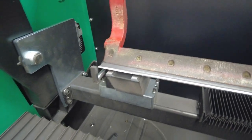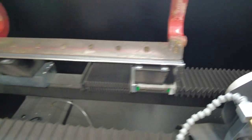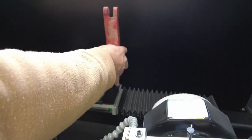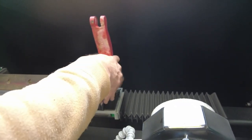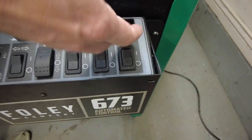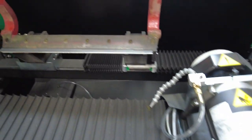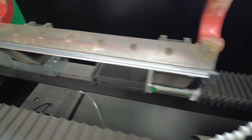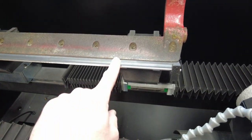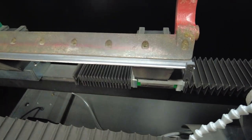To mount these bed knives, we pull these stops out — one here, one here — and then Mr. Crowley is going to slide the bed knife right to the edge of those workpiece stops. Got it. Very nice, and there's just a switch here that turns the magnet on and off. Magnet activated. How tight is that on there? That sucker's on there. Super strong electromagnets hold the bed knife on, and that gives you access to the top face and the front face of the bed knife.